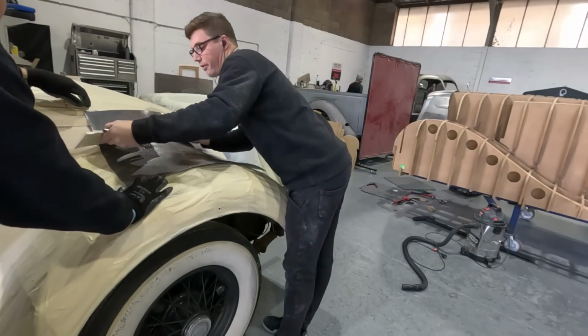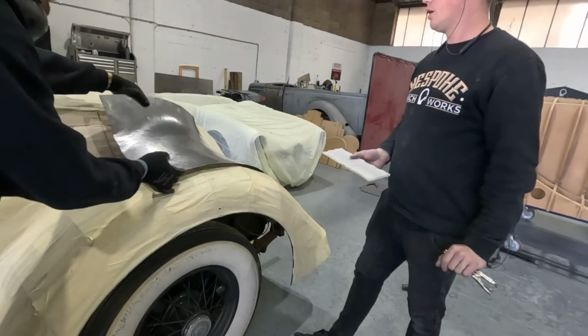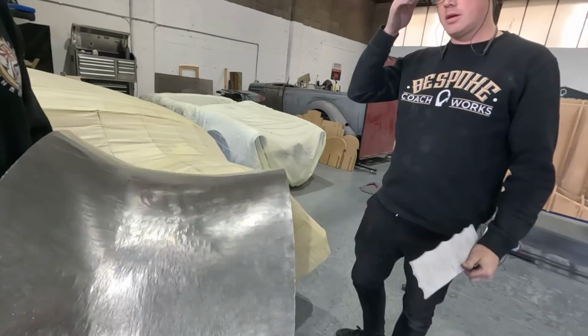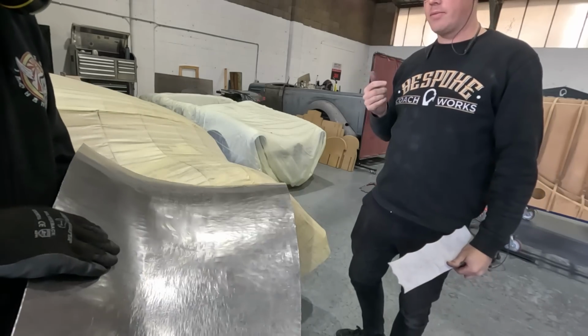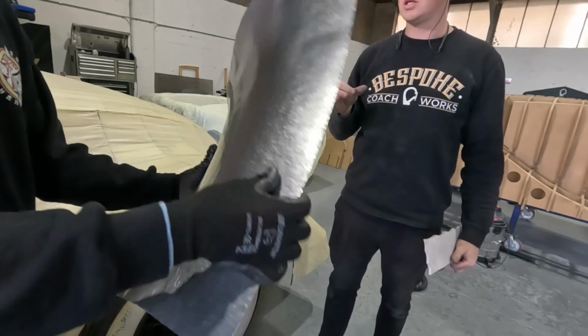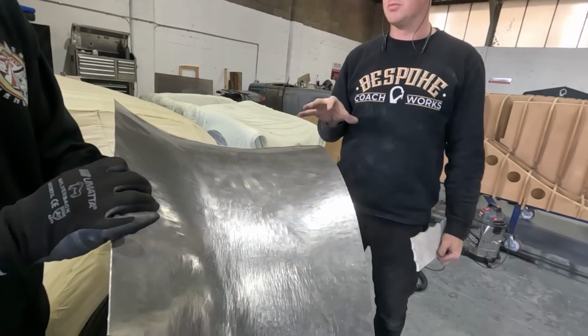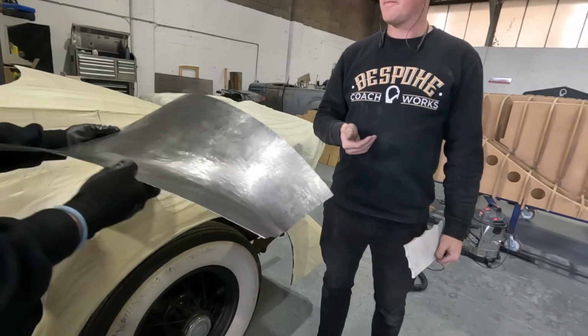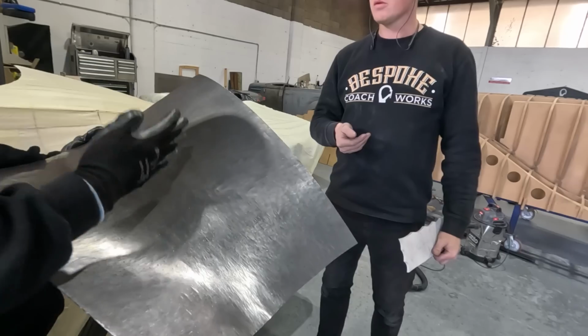Yeah, it's pretty well 24 the whole way through. So just running it with a 24 wheel on the 24 bottom, going this way until we get up to this spot. We should then be able to blend over the whole thing because we're using such light pressure. We're more trying to smooth than stretch, so we're just tracking from one side to the other.